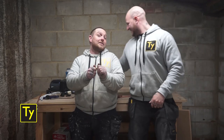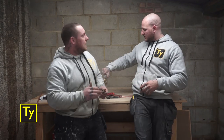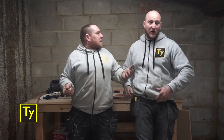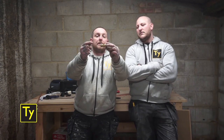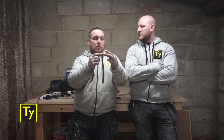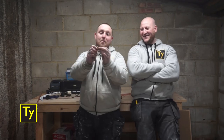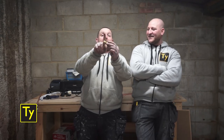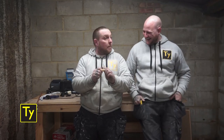Compression fittings — he does get leaks when he forgets to tighten them off. Look, everyone gets leaks. Any plumber who tells you they don't get a leak is a liar — it's just mathematical. If you're fitting a thousand fittings a year, of course you're going to get a leak. So that's compression. If you just disregard that middle bit, that could be any compression fitting — that could be an elbow, a T, a coupling — they all work on the same principle. We can talk about other compression fittings another time, we'll do another video and get the whole selection out.